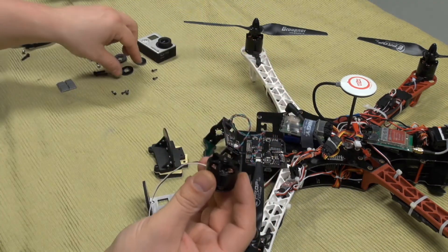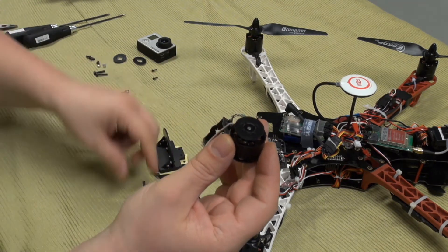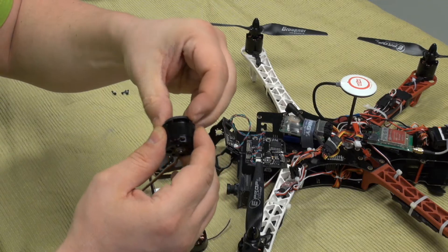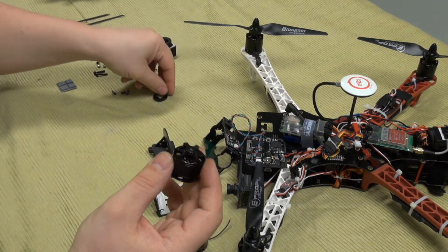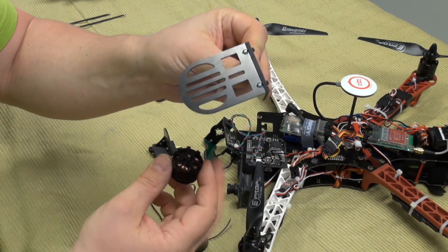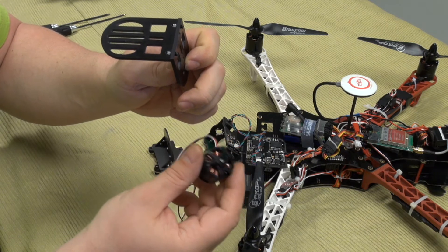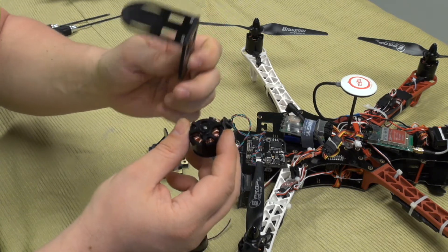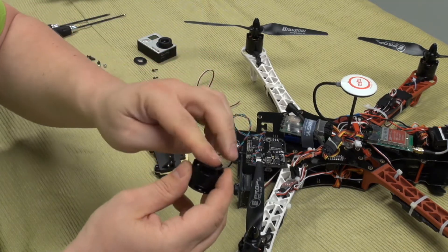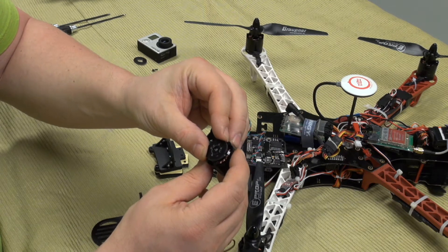This means that we only need one of the mounts when mounting to the gimbal. It can be quite tricky to mount because the gimbal frame is pre-cut for the E-Flight motor, which has four holes for screws, and the Viacopter motor only has three spaced 120 degrees. So we need to put on the spacer to get it flush and adjust until you have three holes that fit.